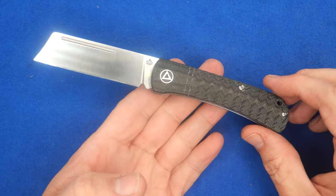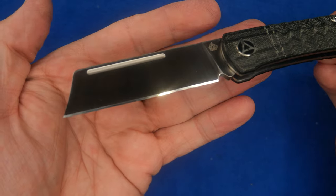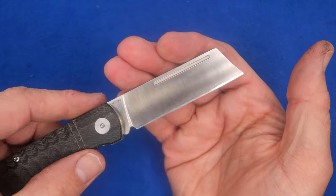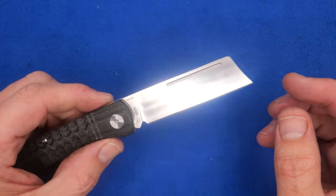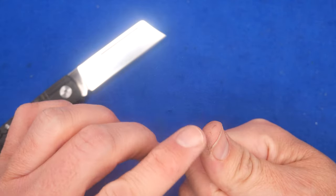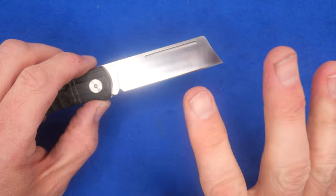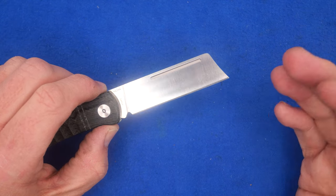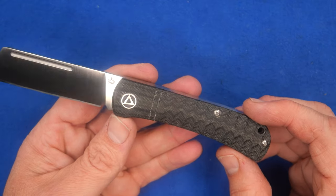This is a section I'm inserting now, after I've sharpened it. It's got a beautiful edge on it — I decided on 17 and a half degrees per side and it sharpened up very, very well. It's scary sharp; I'm literally scared to put my fingers on the edge. It's 14C28N and they say it's at Rockwell 60, plus or minus a tiny bit. I think they're spot on — I've got a pretty good feel when sharpening knives for what the hardness is.